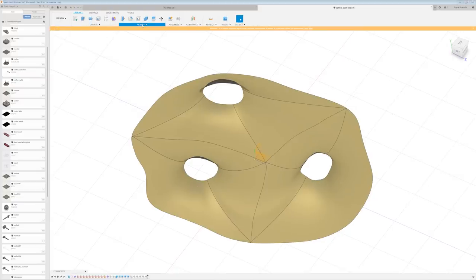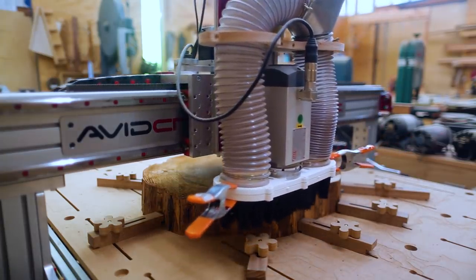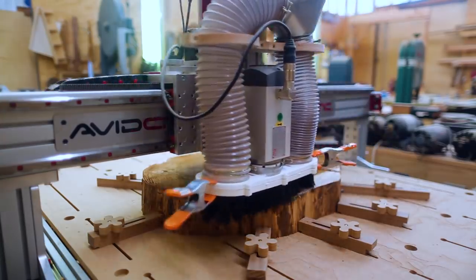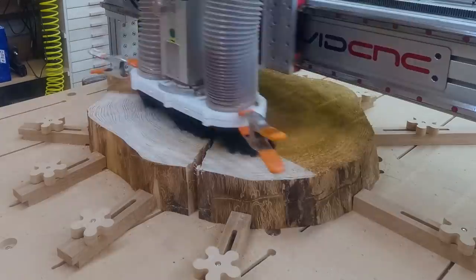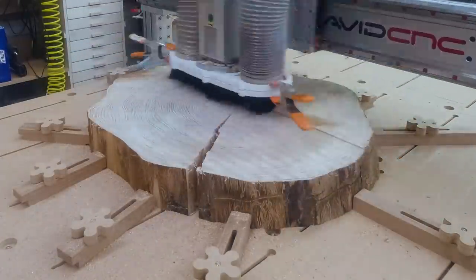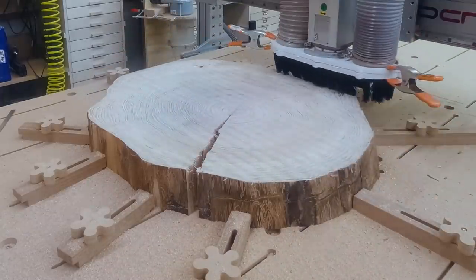The legs and the underside of the table come from the same model, so hopefully they'll match up when I put everything back together. This is the surface of the underside — it doesn't have the thickness of the tabletop, just what's going to get cut. The first thing is to flatten the underside, so I ran some passes just to make it flat and parallel to the table. It's always a little tricky as you're never quite sure where the high spot is, but I stay a little high, get one pass, then step down. I have the two-inch bit in, not going more than an eighth of an inch deep each time, and now the bottom is flat.